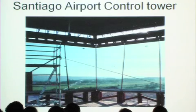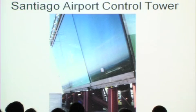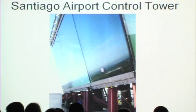And this is where it was used for a real technical reason, which is an airport observation tower. And the glass holds up the roof, and there are no mullions, you see, so they can get a better view, 360-degree view around there. It's quite high as well, it's about 4 meters. And it's actually insulated as well, panel. There's a trick, actually, because you fix the glass at the bottom and fix it at the top. So structurally, you do something which makes it much stiffer, because they didn't want this to deflect much either, because that disturbs the vision.